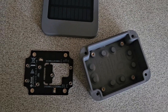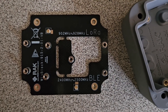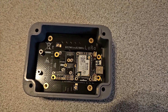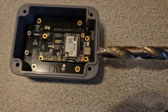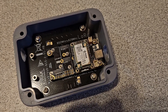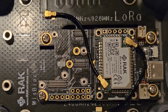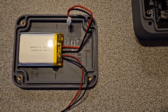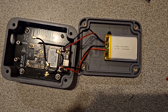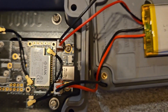This is the Unity Box, with the backing plate having the antennas built into it — a 915 megahertz LoRa antenna and a Bluetooth antenna both on that one board. Here's the board mounted. I just need to drill a hole so I can plug in the USB cable. Hole is drilled. I connect the little pigtail leads to the relevant antennas, tape the battery inside the lid, and connect everything up. Battery is connected, solar is connected, and the two antennas are connected.